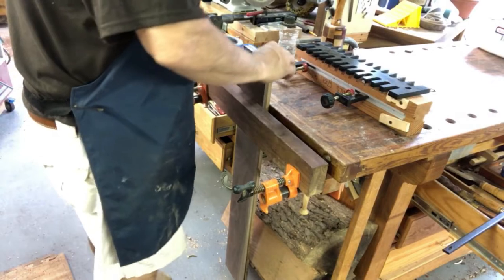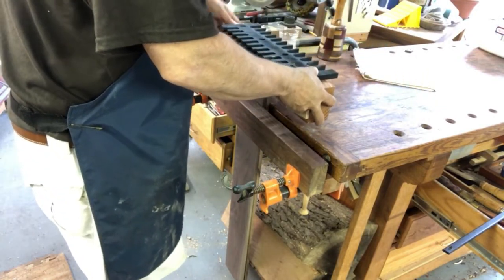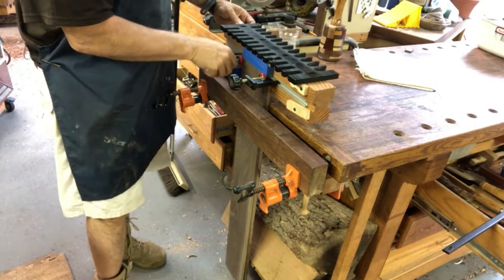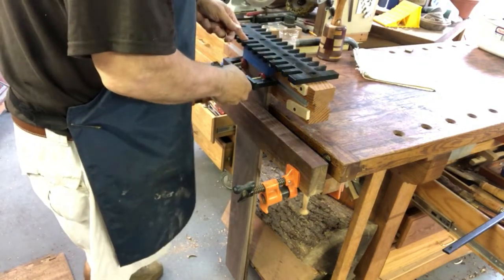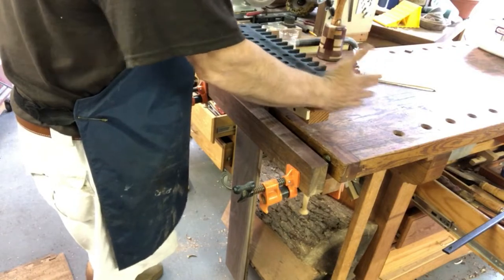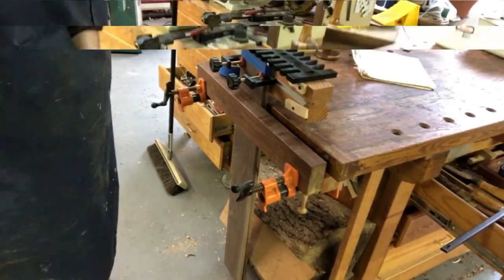So this is a really handy vise, and as you can see here, I usually like putting tape around the wood in order to prevent tear out. And then you just line this up on each edge. Again, that's why I cut it exactly at 5 inches. It could have been exactly 5.5, 6. I did have some flexibility with the width of this box. So you can actually cut the dovetails at the same time.